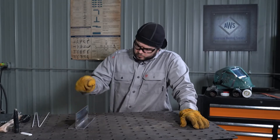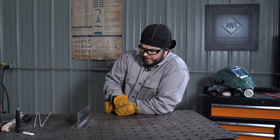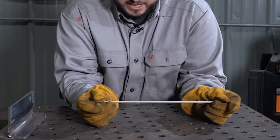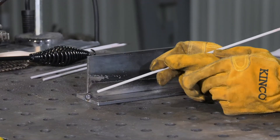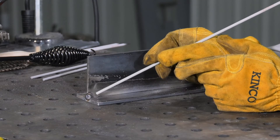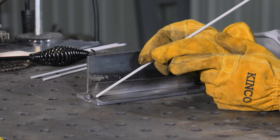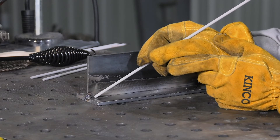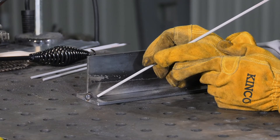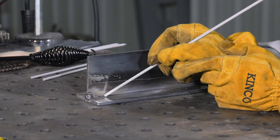The T-fillet weld. Here we got quarter-inch material already tacked together. I've gone ahead, prepped it by removing the mill scale with an abrasive wheel. When we weld, we're going to be using E7018. I'm going to strike this arc off the corner and the tack and begin to build that weld pool up. Once I get it established to about a quarter-inch in diameter, I'm going to maintain a work angle of about 45 degrees and a travel angle of about 30 degrees. We're going to make a very slight side-to-side motion, controlling that arc, and watching it penetrating down into the joint root while we're welding.